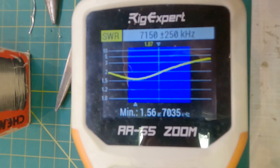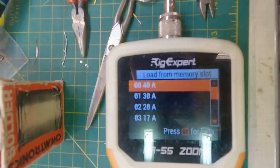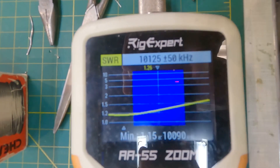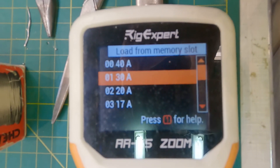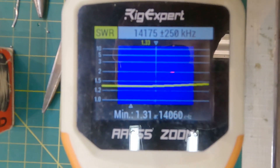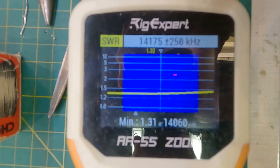To help with the glare problem I saved the data off. There's my 40 meter data after it's fully assembled - perfectly centered on the CW portion of the band. On 30 meters it's not perfect but below 1.5 to 1 across the entire band. And the 20 meter band is well under 1.5 to 1 over the entire band. I'm real happy with the way this turned out from a matching standpoint, which means I don't necessarily have to use a tuner.